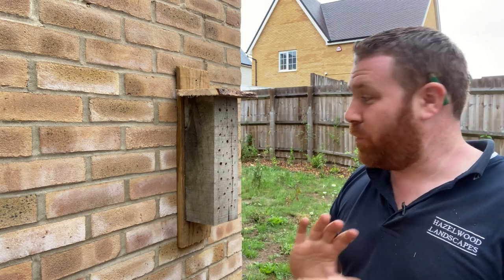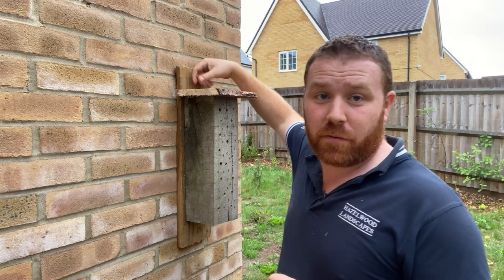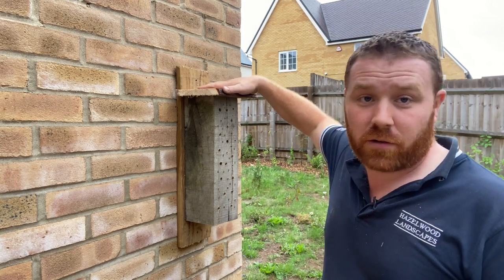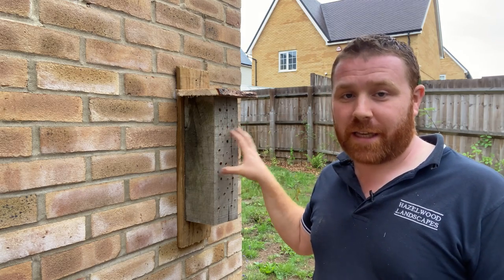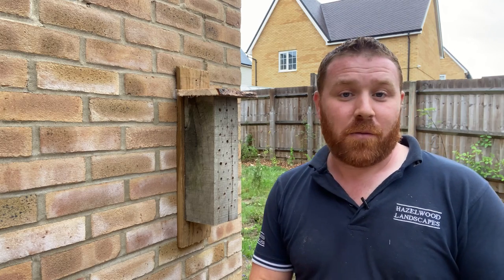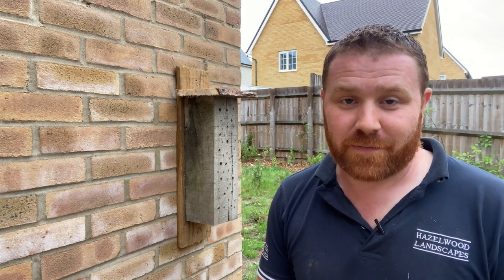Let me know how you get on — get some of these made. It will cost you just a few pounds. The back plate is just pressure-treated gravel board you can get from your local DIY or fencing centre — the kickboard that goes around the bottom of a fence. The top can be whatever you want, just to keep the weather out, and the main piece: untreated timber, as chunky as you like. The depth of the hole and the size of the hole are the key components. Make yourself one — or ten — and spread them around the garden. Thanks very much for watching; feel free to subscribe and give the video a like.